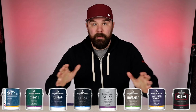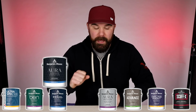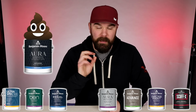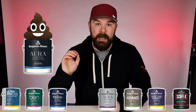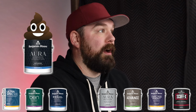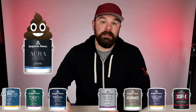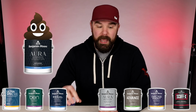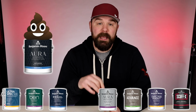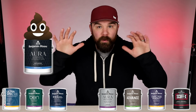And next up, this product line is technically above Regal Select, and that is their Aura line of paint. And I politely disagree, because I think Aura is overpriced and hot garbage. In fact, the last time we used Aura eggshell, we had a terrible experience. The client requested it, and she also picked a color that was only available in Aura, and the paint went on terribly. It was super slow to cut in, and then when we rolled it, it actually sagged off the wall, and it looked like the walls were weeping.